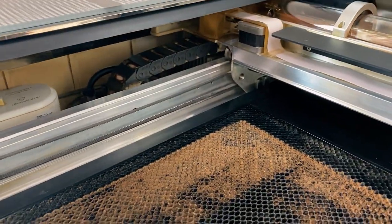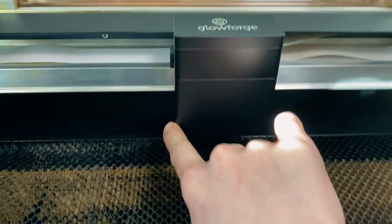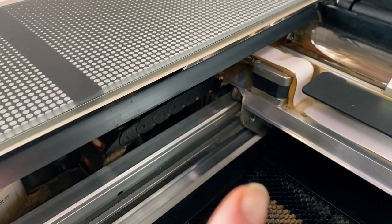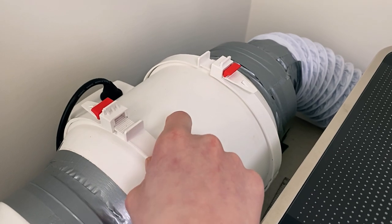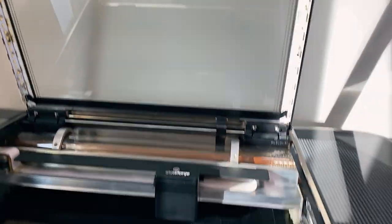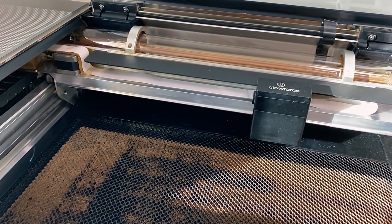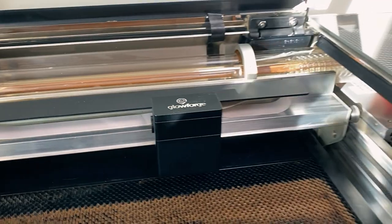It's going to cut a lot better now. The main things to clean on the Glowforge are the little fan inside the laser and the fan behind it. Since our warranty ran out, we actually upgraded to a more powerful external fan that's a lot easier to clean. Going into owning a laser, the cleaning process is something I didn't really know about — it's not that bad, but a little annoying. It makes sense since it's filled with smoke and soot.